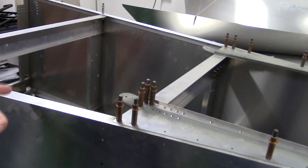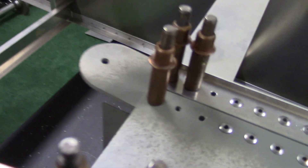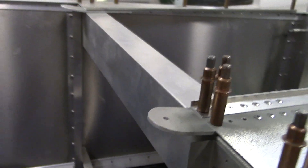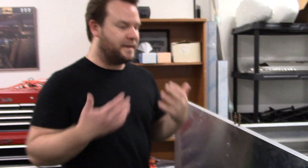One thing I did want to mention is that I've been using self-etching primer on all contacted sides of all the aluminum pieces. When I made these bends, there were little tiny scratches in the aluminum skin, and that mixed with the bending surface area can lead to corrosion. So you really want to make sure that you use the self-etching primer to eliminate the chance of any corrosion happening — that's why I specifically chose to go with self-etching primer.